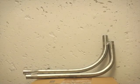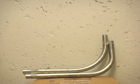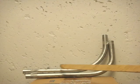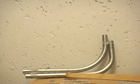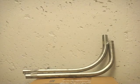To illustrate the difference between the standard 90-degree bend on the regular conduit bender versus the sharp radius bend, this is the traditional 90-degree bend. You can see how much tighter the sharp radius bender bends a stick of conduit. It makes it much more difficult to pull wire through that, and that's why they are generally not allowed by the National Electrical Code.